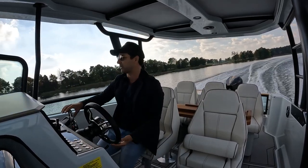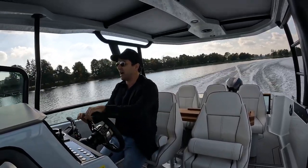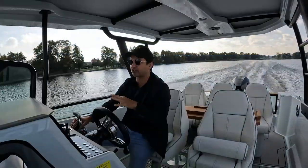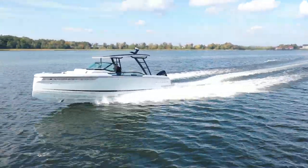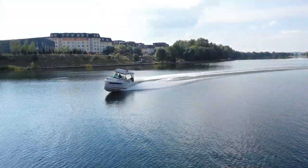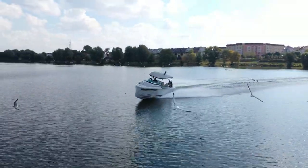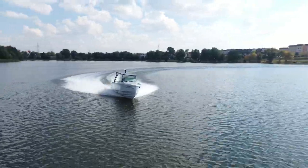I can't talk to you about what it's like in rough weather or whether you get water over the bow because I'm on a lake. But at the 27 knot cruising speed, my rev range is 4,200 to 4,300. I've got a 300 litre tank of petrol on board and I'm currently running 40% on board. I've also got a 55 litre water tank and a 55 litre holding tank — obviously empty on this test boat. It's just me and Donut on board and some camera gear, so she's a pretty light boat, but the performance is amazing.